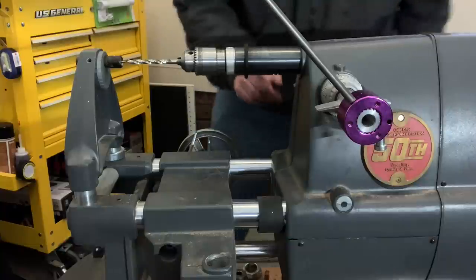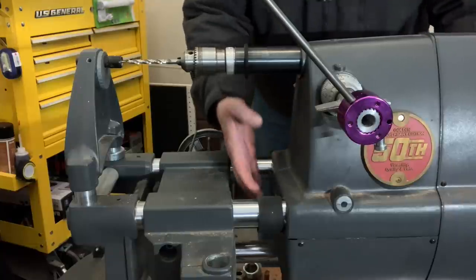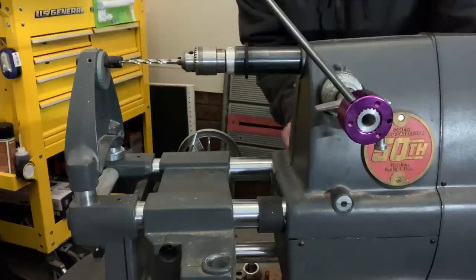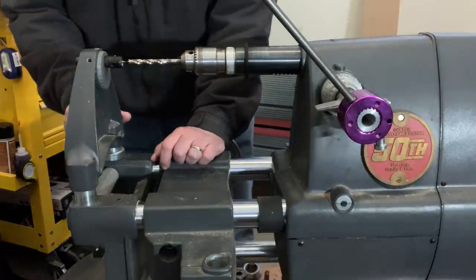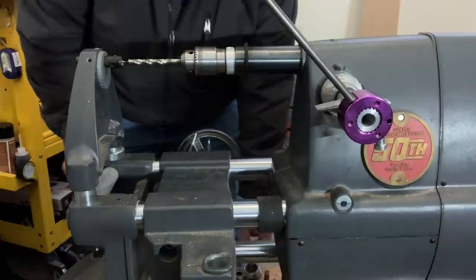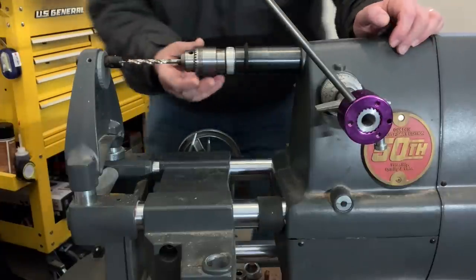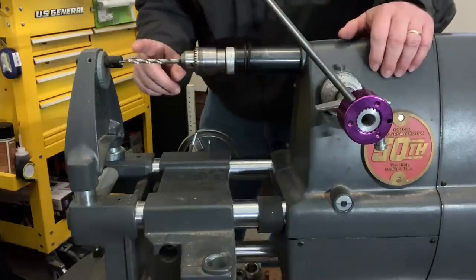Before making any adjustments, I need to be sure I tighten the headstock. When we tighten the headstock, the lock is actually lifting it. So watch that point as I tighten and loosen — you can see it moving around. Once it's locked, it's locked in the proper position, but we want to be sure it's locked when we operate the machine. Here we can check that we've dropped to the proper height and tighten that set screw on the stop collar.